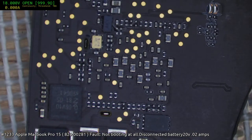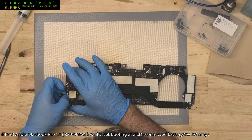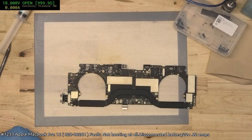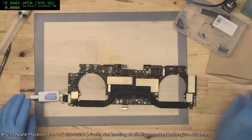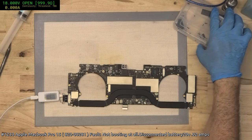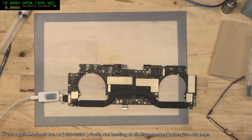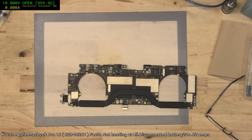Alrighty. Time for me to plug it in and just verify some things. If nothing else, the 1502 is still booting and behaving, so another couple of days and I might be moderately considering letting it out. What have we got? Goes to 20 volts and smack bang on zero, so we've got a short somewhere. Something shorted on the circuit board.